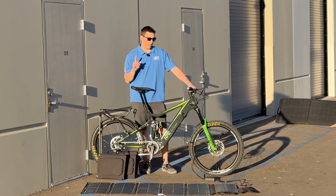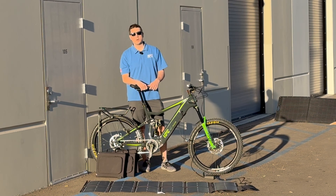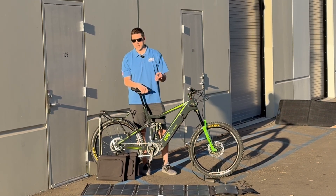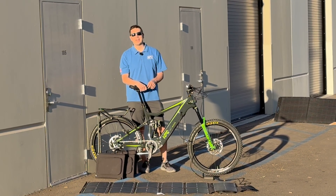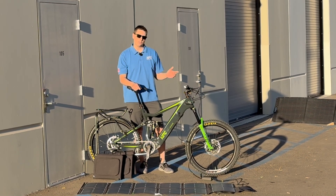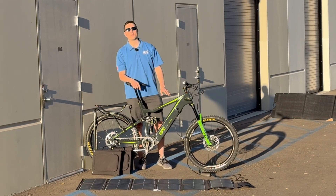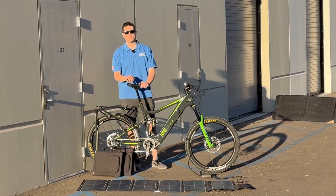After using these I can tell you that even in January they work pretty darn well. With the 180 watt panel, even though we're not getting full sun I'm still getting 120 to 130 watts of output out of this system. We've been charging batteries all day to power all our lights including our bikes and testing everything, and they've been doing pretty well.